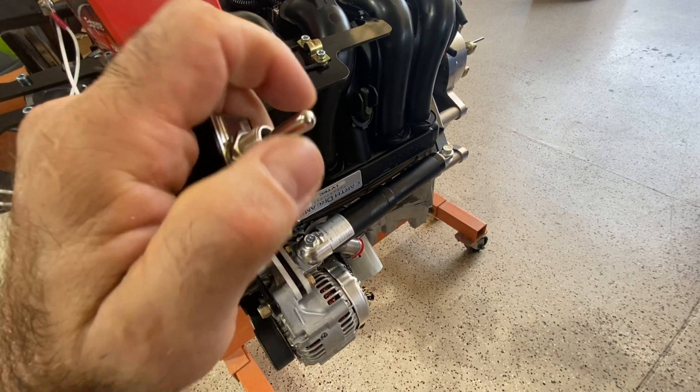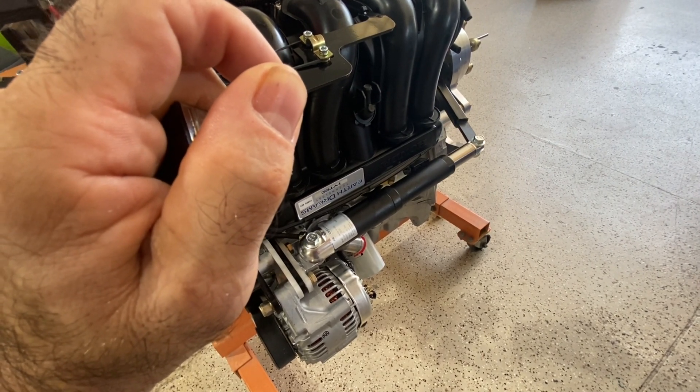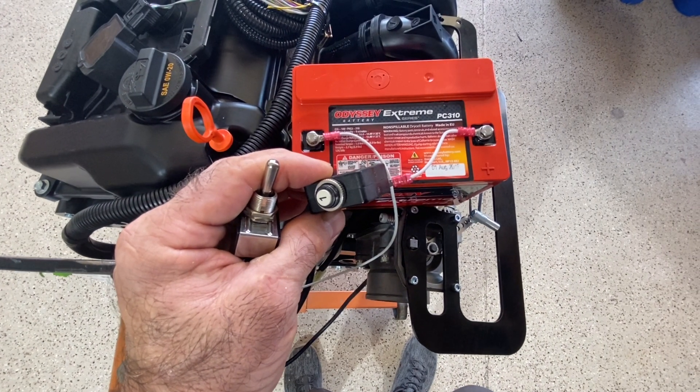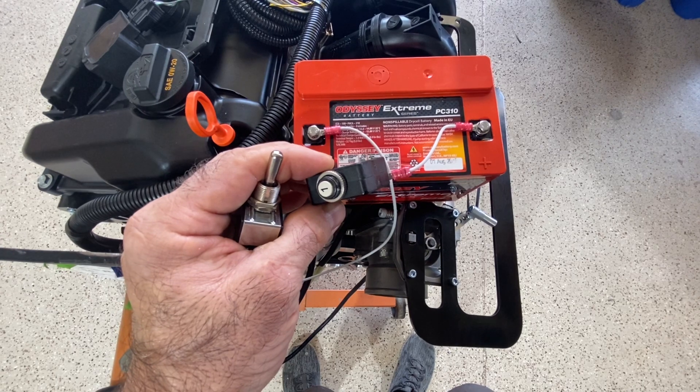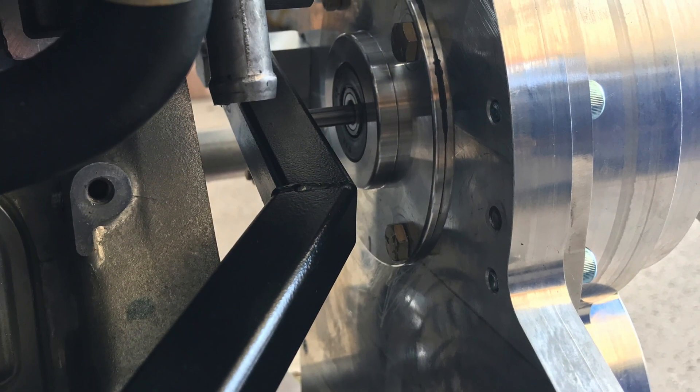Use just a regular toggle switch and move your actuator back and forth just a tiny bit at a time to change the blade pitch. We're just playing around with a one-amp breaker here. It will be a minimum breaker size in the airplane so that you can't break any parts.